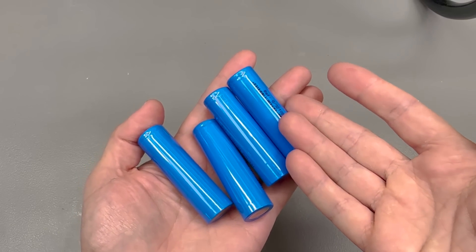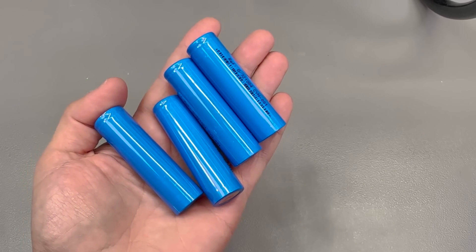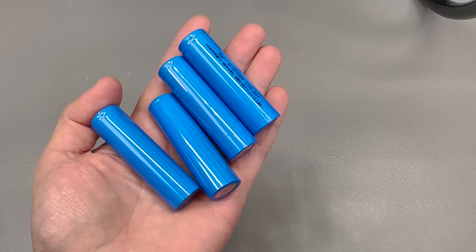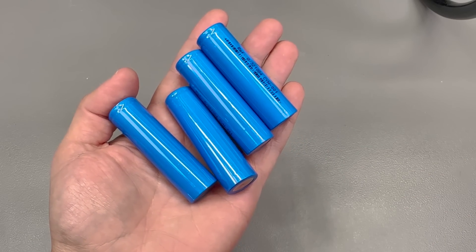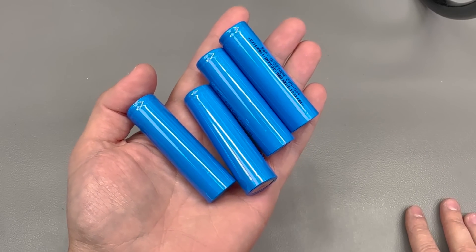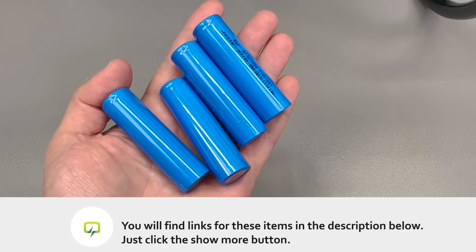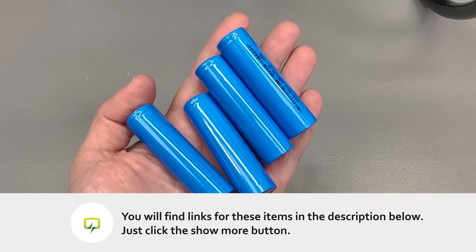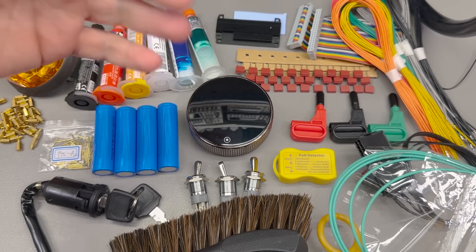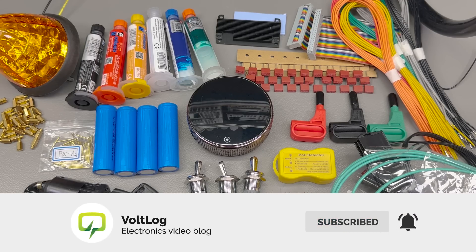However, their biggest downside is lower energy density. While lithium-ion 18650 cells can exceed 3.5Ah capacity, these sodium-ion cells typically only provide around 1.3Ah per 18650 cell. I just wanted to get a set to have this chemistry on hand in case I need to design a circuit based on it for a client. If you'd like to see testing — like putting a nail through one to see if it catches fire — let me know in the comments. As always, links for all items are in the description below. That was all for today — I hope you found something interesting to order!